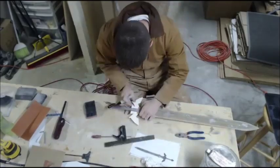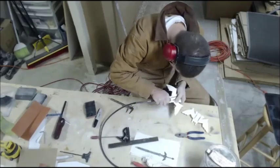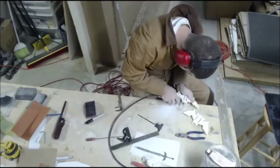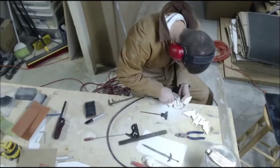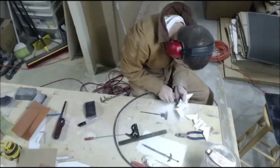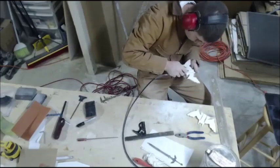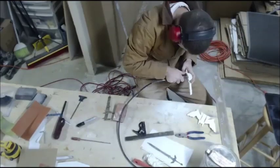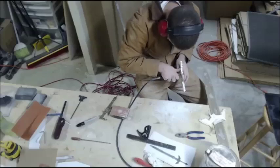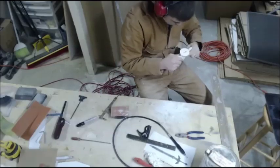You'll see me finding the perfect centerline on the sword and on the hilt pieces, and then I'm turning to a Dremel to actually clean out and set the channel for the center piece of steel that runs down the length of the sword blank. I'm just using a simple grinding bit — nothing special. It does a really clean cut which was important to me. Then it's just a matter of constantly: remove a little, check, remove a little, check again, remove a little more, check. You never want to just go until you think you're there — you're pretty much guaranteed to shoot way past where you need to be.